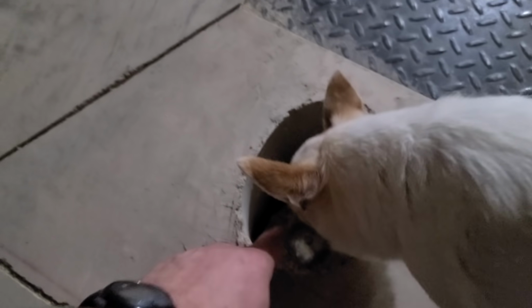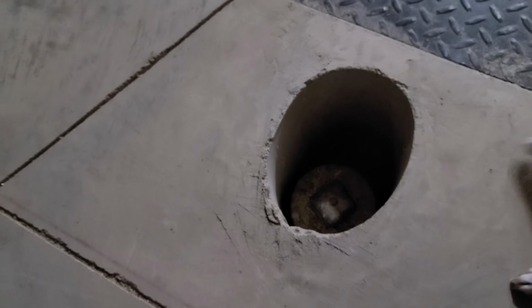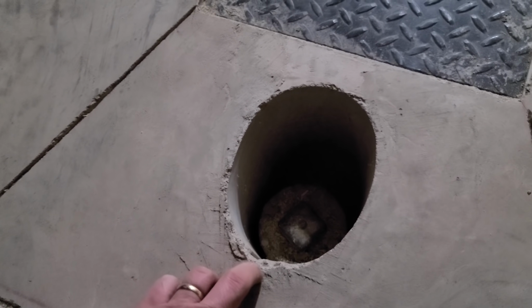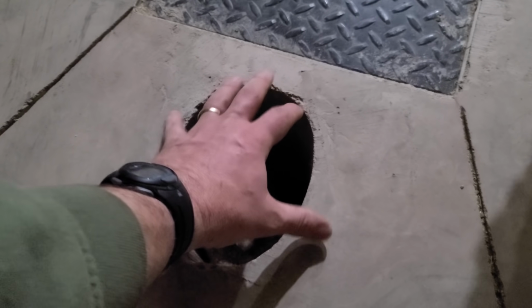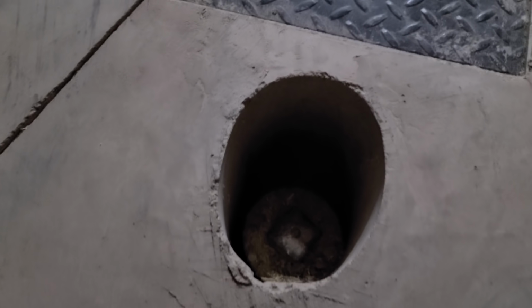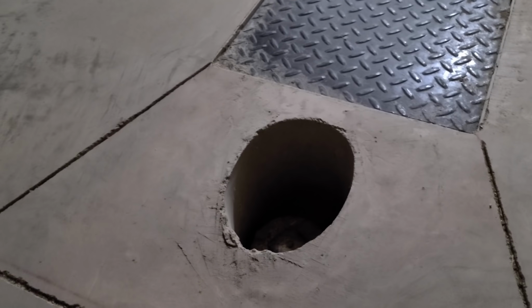I'm thinking about just getting some rubber, because it's just a clean out, which you might never have to access. But if you do, a guy can put a big bead of silicone and cut rubber maybe an inch larger all the way around and silicone that to the floor. It's kind of sloped up anyway, so I don't think water is ever going to go in there. But the silicone will seal it. We'll clean out all that dirt and gunk and sawdust. At least if it's siliconed, it's sealed, so no junk can get in there.